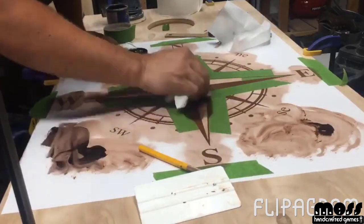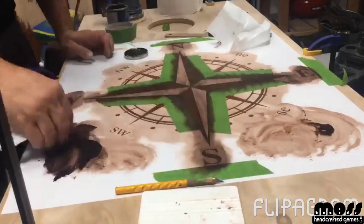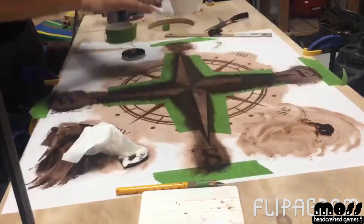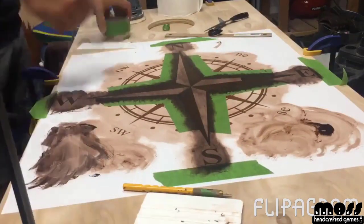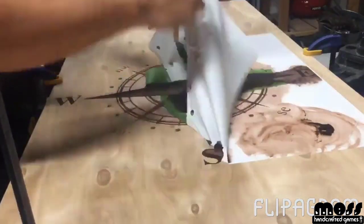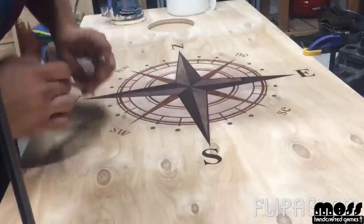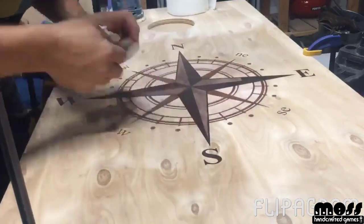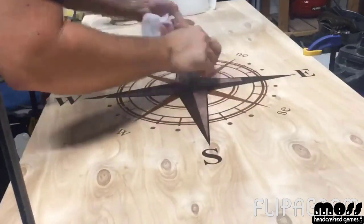This basic technique is used for all of my designs. Sometimes it's one stencil with frog tape or painters tape — the green stuff or the blue stuff — to mask and stain a second, third, or sometimes fourth shade. Other times I'll make two separate stencils and apply one over the top of the image after I apply the first color. When you remove the vinyl, be careful — you don't want to rip it off too fast or pull any of the grain off with it. Pull it off at a sharp angle, diagonally from the wood grain, and it tends to pull up fewer fibers.